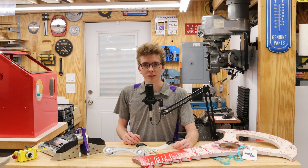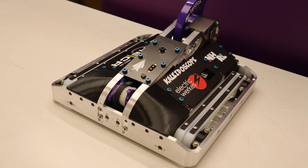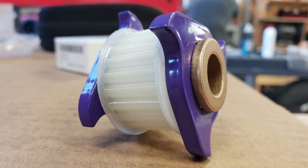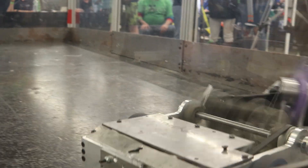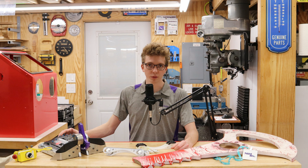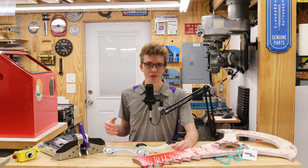The one thing different about the weapon system on Kaleidoscope V2 is the rear weapon. It's a very small little piece of 3D-printed pulley and titanium that sits at the rear of the robot, connected by a belt to the main weapon. It spins a little bit slower, but it runs off the same weapon motor. Its goal is not necessarily to be a weapon, but to help with self-righting. At Extreme Bots we were able to drive upside down with our weapon hovering over the floor, and the idea of this rear weapon was to help bite into the wood floor and propel us across the box at Norwalk. It was definitely lighter than putting a dedicated self-righting arm on there.